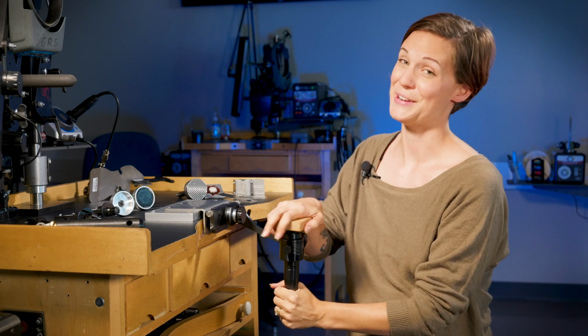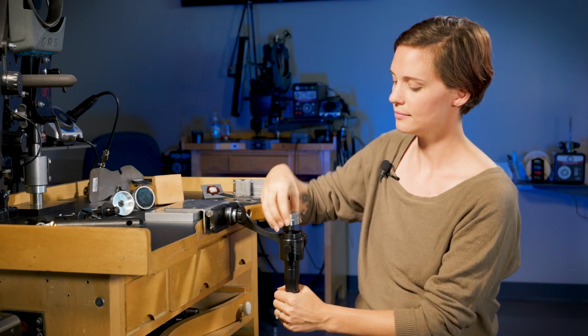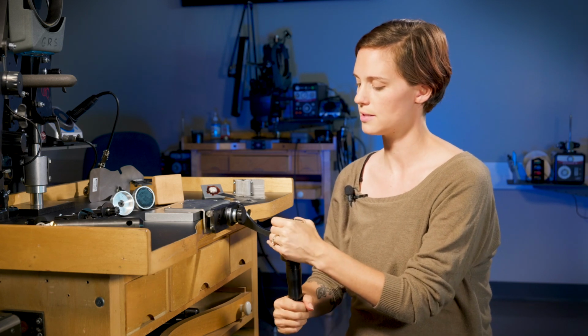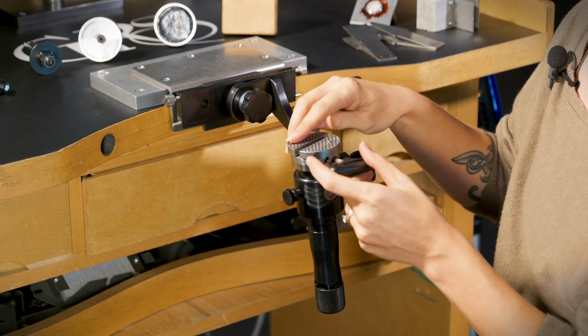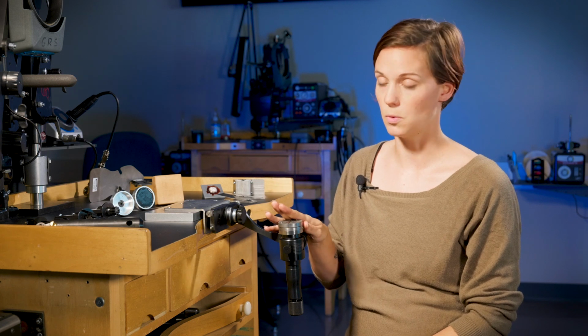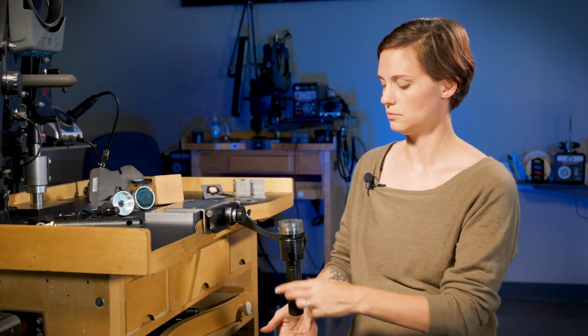Okay, then you have, last but not least, the pin vise. This is a really good option for those of you who are torn between the Benchmate system and using a standard ball vise. This opens up just like any other vise. It comes with little pins. There's steel pins and then there's brass pins that won't mar your work. There is something similar to this out on the market. The important thing about this one is that it is self-centering, so it's gonna stay underneath the microscope where you want it, and it's made with good quality stainless steel jaws.